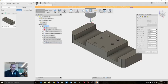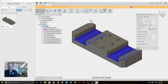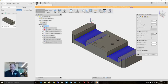Let's move this. Hello, move. Oh, I didn't press OK yet. I said 25 inches a minute, 25, 25. That's okay. That's good. Bottom height is okay. Stock to leave, 10 thousandths there. It gives a beautiful floor finish, by the way. And we're going to say that I don't want it to go more than 50 thousandths depth of cut, right?